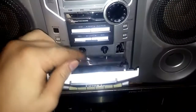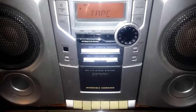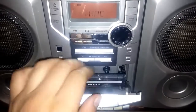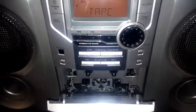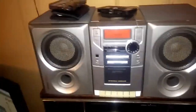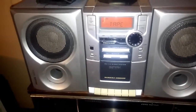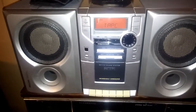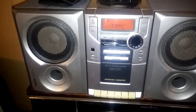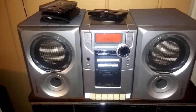It's not the speakers and it's not the board that controls the speakers. It's literally just when you record — it sounds like static. When you turn the knobs it's all staticky, because of dirty potentiometers and all that. This thing unfortunately cannot record worth anything. There was a spot, however, where the static stopped and it kind of kicked into normal gear for about 10 to 20 seconds, and the recording actually sounded very, very good for such a small unit. But then the static kicked back in, so there's something wrong with the record board. Which is too bad because this is a nice little system and I really wish it would record properly.